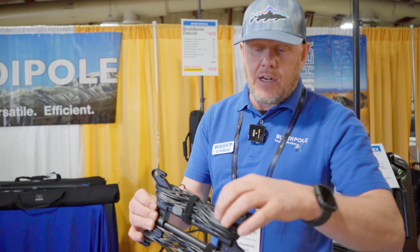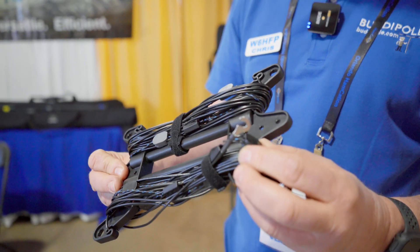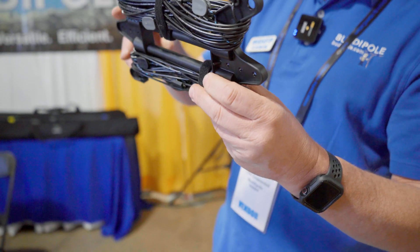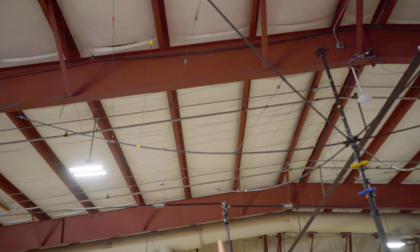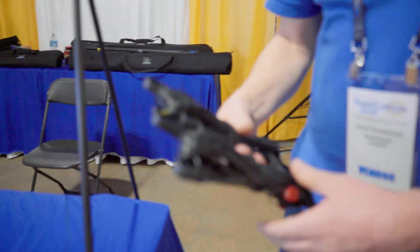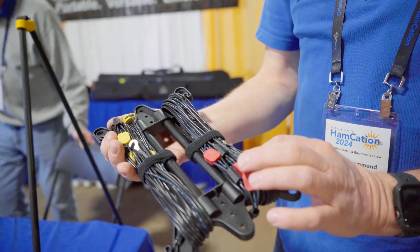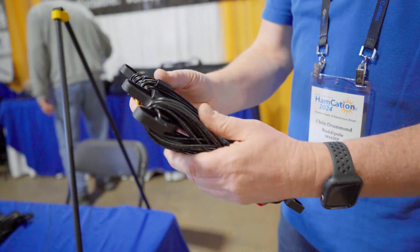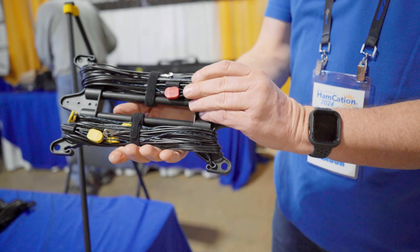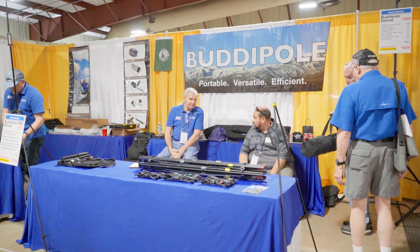These are the wires — it's all color-coded, so gray is ten meters and black here would be for six meters. Up on the antenna itself are the wire clips, so it's really easy to not screw it up, so to speak. These are going to be the 12 and 15 meter wires, wound on a figure-eight line winder so we're not imparting any twist to the wire or the spacers in between.